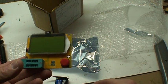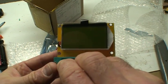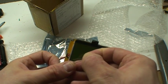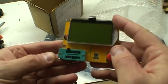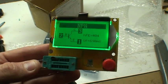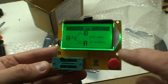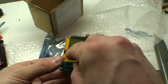Okay, now here's our transistor. I don't know what the leads are, I'm just gonna place it in here across pins one, two, and three. Unfortunately you have to space these apart a little bit because the spacing is not perfect. Powering it up — there you go, telling me it's an NPN, giving me the HFE value, and showing me the collector, emitter, and base on the pins. So I know exactly what the parts are. I'm quite impressed.